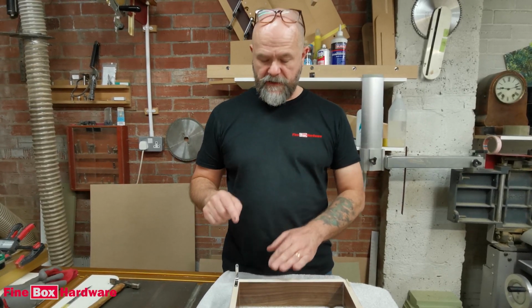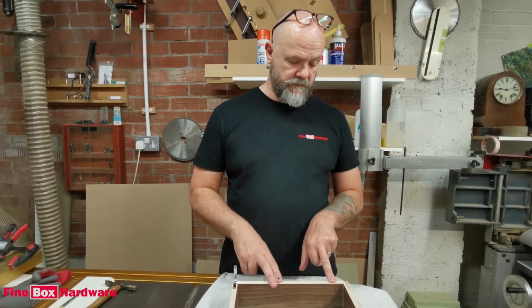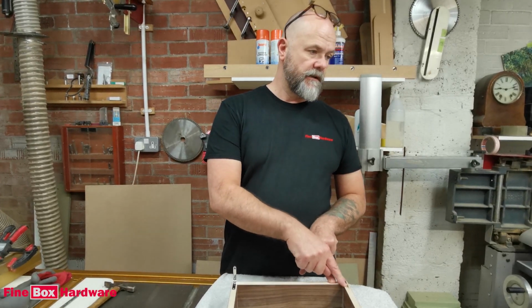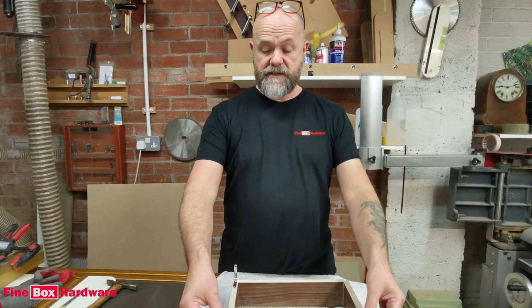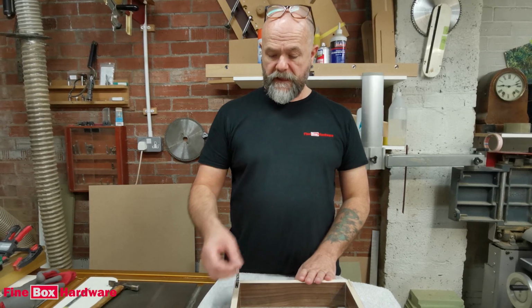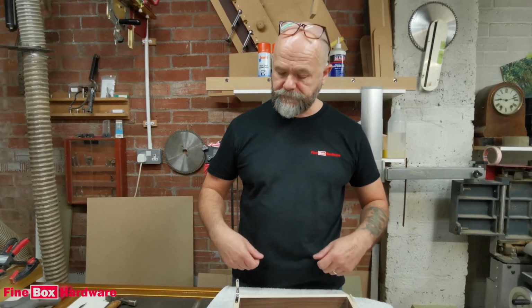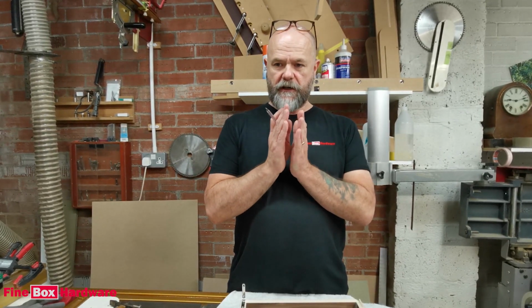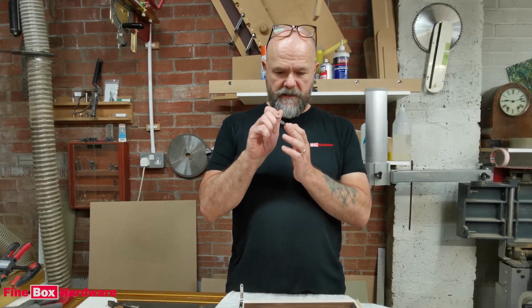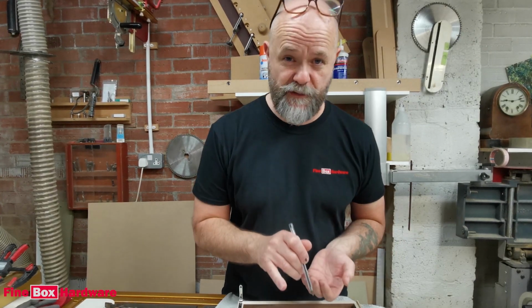towards the front. The problem with that traditional way is it's maybe not so bad when you've got sycamore in here, or, well, ours is an MDF core, but we're still seeing sycamore there. But say you were putting it into solid wood like oak, walnut, ash, some quite hard bits of grain there, and you tend to find that when you push it in, if you've got a hard bit of grain on your center, no matter what, that scratch awl wants to go to the softer point.